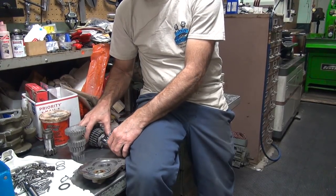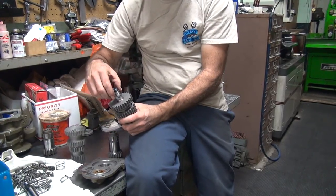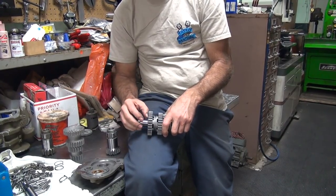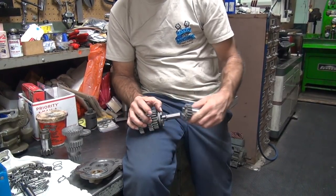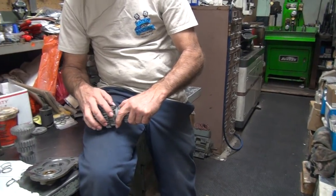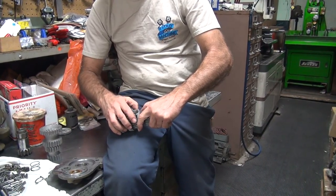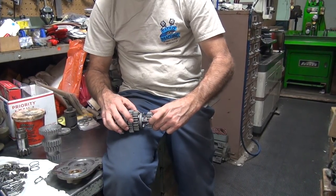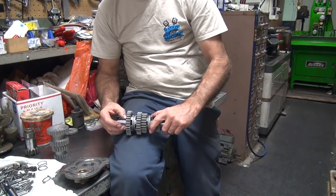Or even more, because remember how we're putting a washer over here now? Which is not supposed to be here. So if I take the 50 thou plus this 60, get 110 off of this, that'll bring this thing in a lot closer where it'd be nice. You can see the engagement's over here, see? That's engaged. That's just clearance from there down. So if I take 110 off of that, that'll put me at only about 70 thou clearance total between the two sides, which would be a nice tight fit. That'd be good. And that'll make this whole stack good.